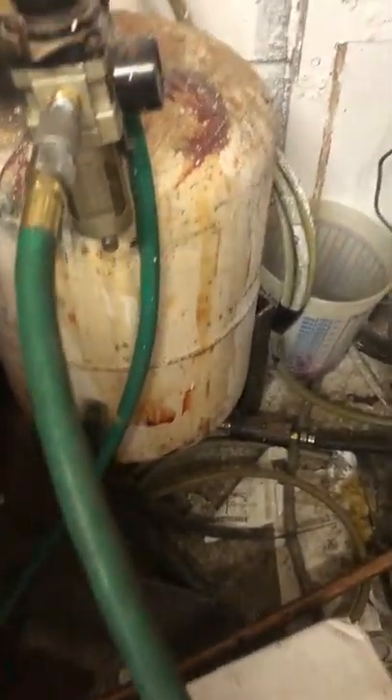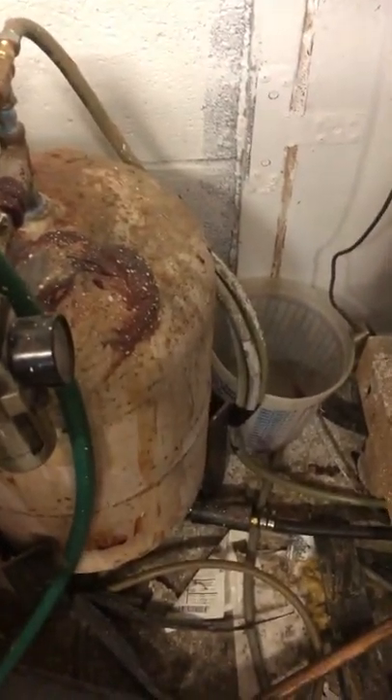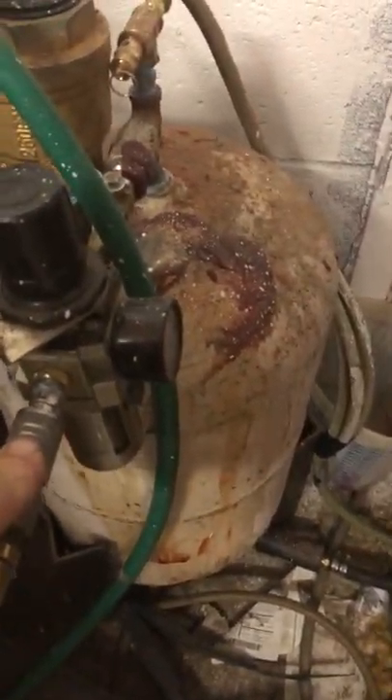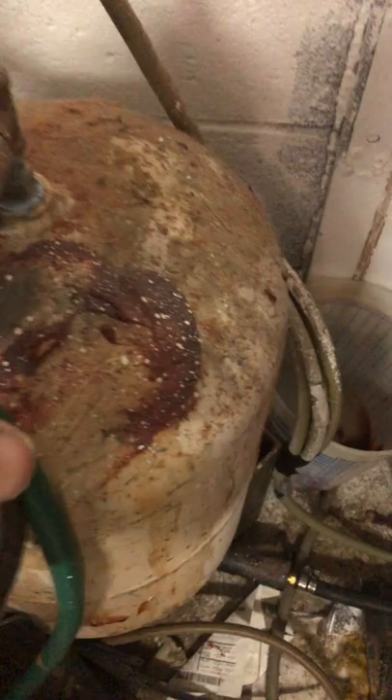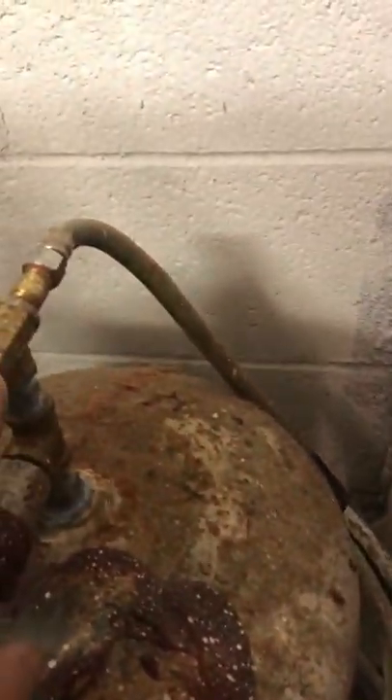My workbench — here's my glue pot I built out of an old propane bottle. The hose comes off the bottom where the glue feeds out. You open that two-inch ball valve, take the plug out, screw this funnel in, dump the glue down in there, close the ball valve, and put the air back up to pressurize it. The air comes out of the wall, goes into the pressure regulator and water separator, then through a small check valve down into the tank. The air off the top fans the glue out and pressurizes the bottle, which forces the glue through the feed hose up to the gun. The air comes in the back side of the gun and fans out.